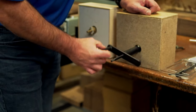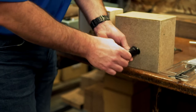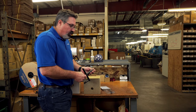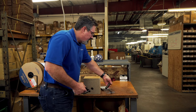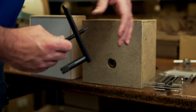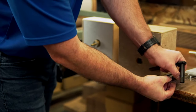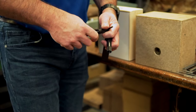Now most people know the issue with the 1200 is that sometimes just the core gets pulled out and it leaves the brass sleeve inside there. That's where this tool really shines. We put the tube aside, the core aside, remove the threaded rod from the crank, and now the crank turns into the expander tube that's going to remove the brass sleeve from the valve body.